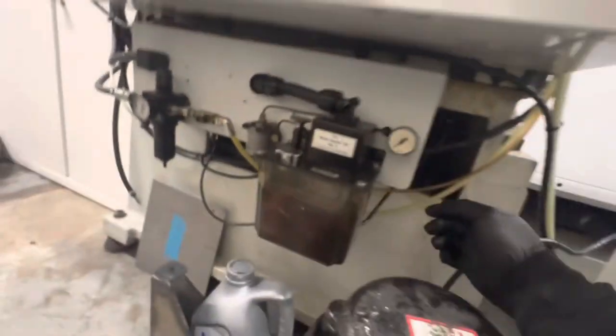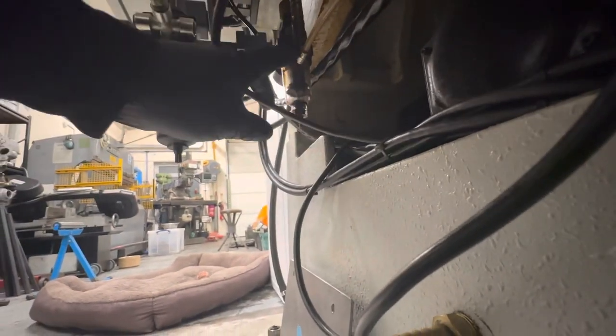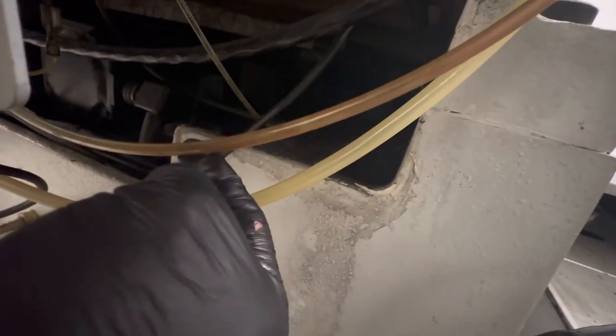But what I will do is, this is the airline which feeds off the back. If I can just try and show you here. It feeds off of this line here, and this is basically like the drip feed for the spindle oil. Now what I will do is I'm going to disconnect this, and I'll take a syringe, only a small syringe, and I'll put a syringe full of oil into this line,